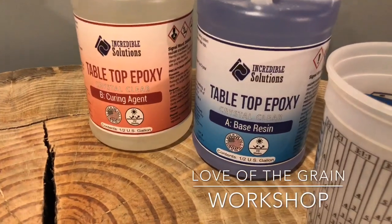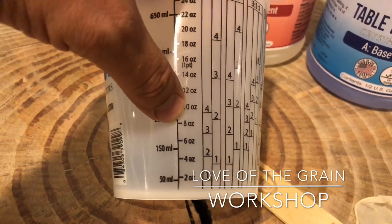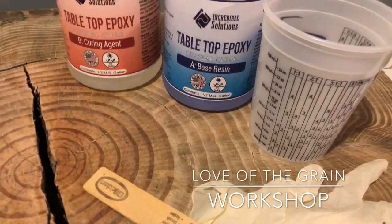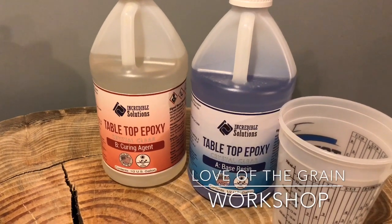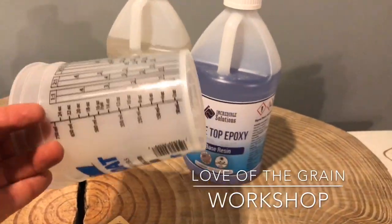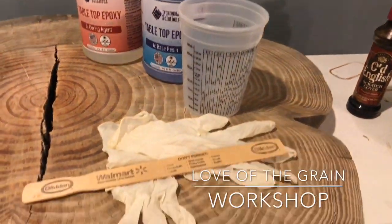To fill this crack we're going to use some two-part epoxy — one-to-one ratio — by Incredible Solutions. Super easy to use: if you want eight ounces, you do four ounces of one and four ounces of the other. It's a really good, reasonably priced product. You can get it on Amazon and it ships out very quickly. It's very easy to use and easy to clean up. I use these little plastic containers which are reusable because the epoxy doesn't stick to them — any excess dries and you can break it out really easily.